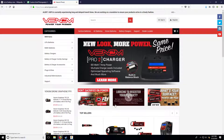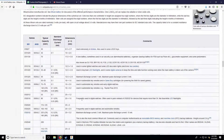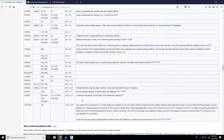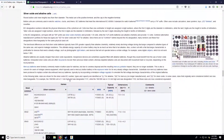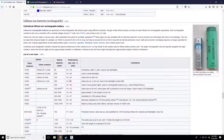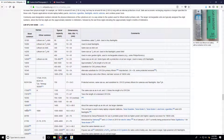Normally on the DJI Phantom we run 2200mAh three-cell. For this build, we're going to be high in cell count because lithium ion has a very very low discharge rating. In order to get it to work fully you need to be very selective on your power supply. The main lithium ion cell right now is the 18650 - it's the number one cell and where they're doing the most research and innovation.